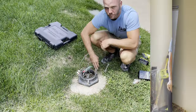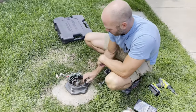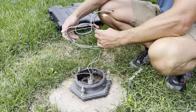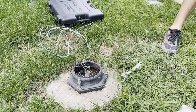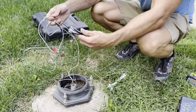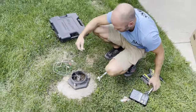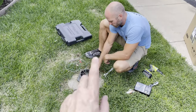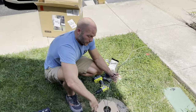This is the remnants of the old post that was broken off. The base was still attached to the ground and it's been sheared off here. We rolled up the extra wire that we had, but the new lamp did come with wire that runs up the inside, so we'll attach this new wire to what comes out of the ground and run it up to the top to tie in the lights. It's always important when working on electrical to make sure the breaker is off, which we have done, so the power is off to work safely.